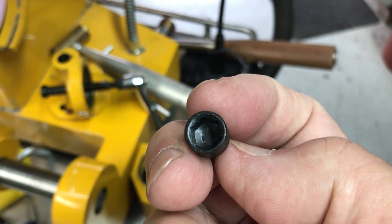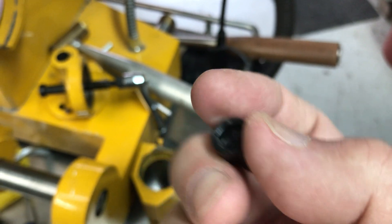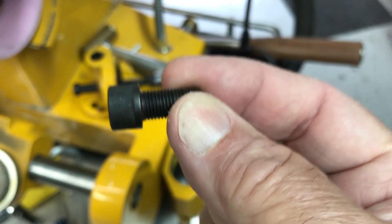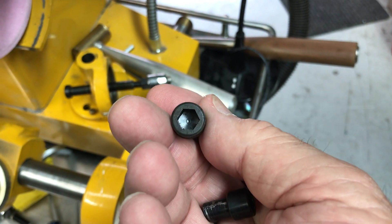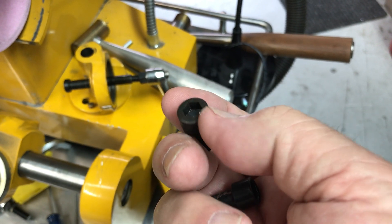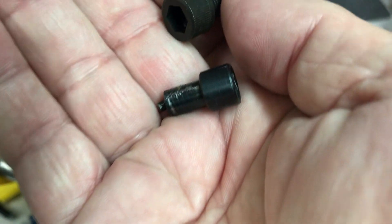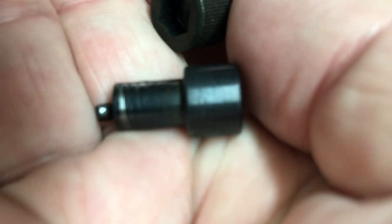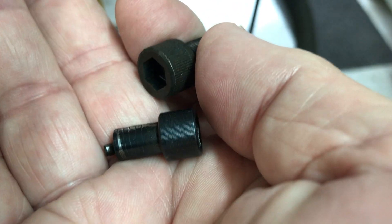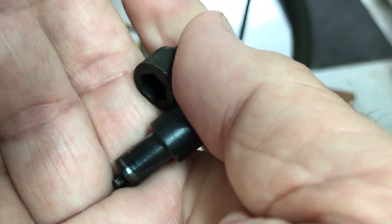You can see it's got a hex Allen key head on it, which is metric, but a 3/8 fine thread. The metric handle fits that also. So I'm going to turn the diameter down on that. You can kind of see there were threads on this original one, whatever they made it out of. And offset it and make the pin. So it should be a fun little build.